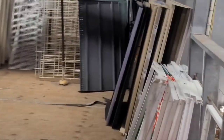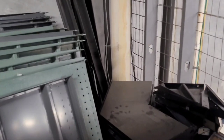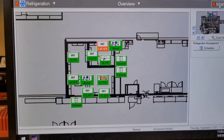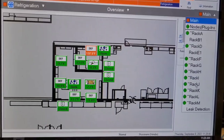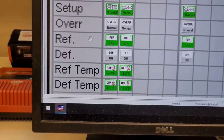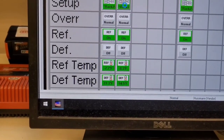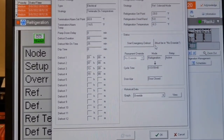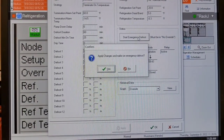On top of the freezer I'm checking where the wires go down into the freezer — looks like they come in the corner with the copper. Before working in that ice-cold freezer, I want to put it in defrost. I go to rack J, click on circuit zero-two, hit setup, then click Start Emergency Defrost, hit Yes, and it starts.